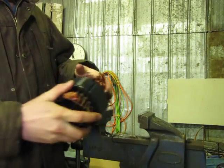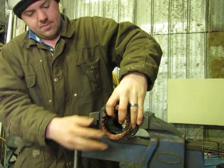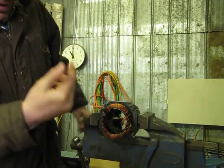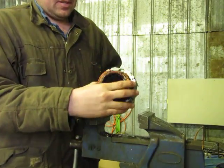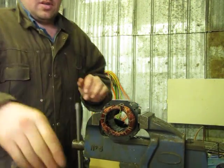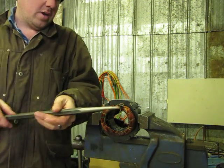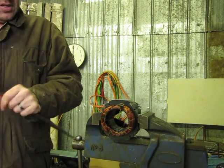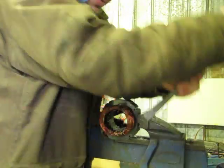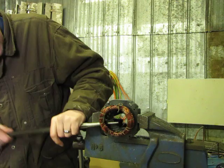Reverse your field — your core — and put it back in the vise. Tighten it down. The best way to do this is to go on those heavier windings; don't try to pull it from the smaller windings. Either a long bar or a long punch — this is the key to getting the windings out of the solid iron core. Start off, pry on it a little bit, start it, do both sides. Try to find the center of those windings the same way as when we were cutting — it's pretty easy to find.